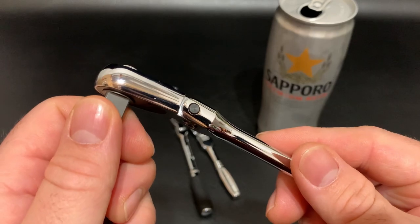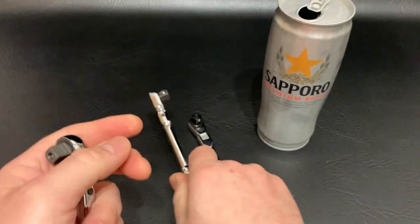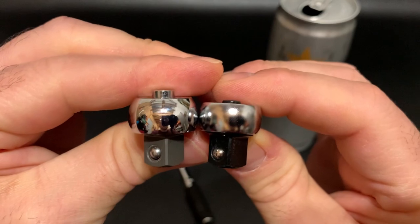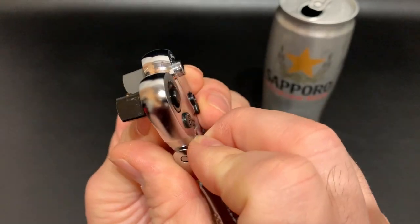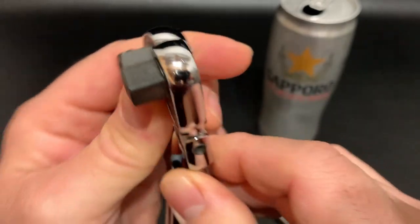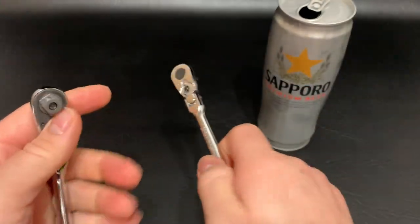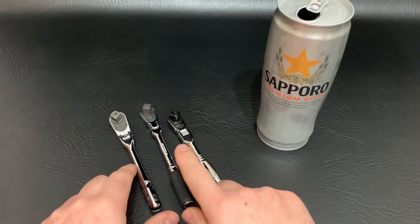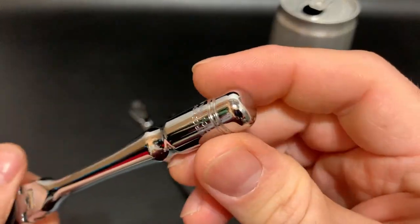This 90-tooth is very loose and does grab the next teeth, so that's not bad at all. This one is locking — none of the other ones are locking. The locking button does stick out a lot on the Nepros, which is another drawback. The Tone is more flush than the Nepros, but the Koken is super flush right here — you can see that right off the bat. Another win for the Koken. I get this question asked a lot: which one should I go to? Koken's definitely the winner — keep an eye on them this year.